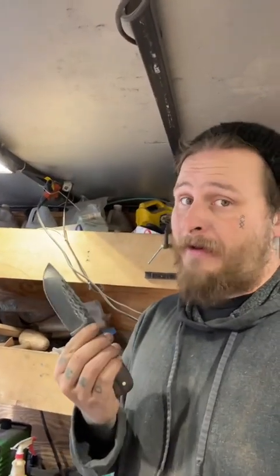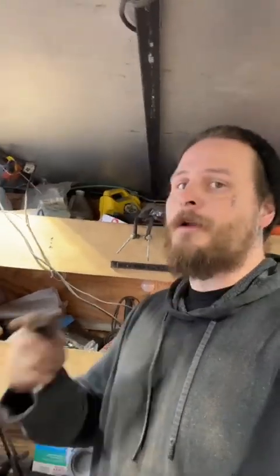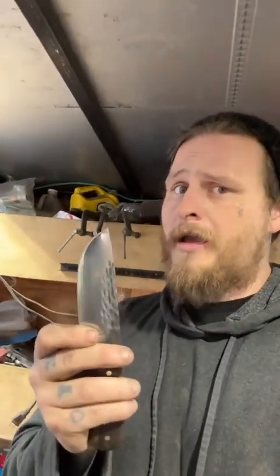Now doing it in this fashion will polish some of your bevel. Or if you're going for an etched finish or something that's not polished, definitely do this before you do your etching. As you're doing this, you will start to notice the same thing, a very, very tiny wire edge begin to form, and that's what we want. Take that burr off. I use just a scrap piece of leather. Just the same as before, just run the edge along it. You're done. That is all there is to it.